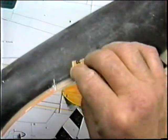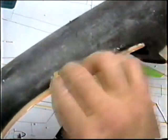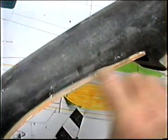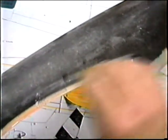And the idea on a fillet is not to build up a lot of paint, especially if you're using something with talc in it. Anything with talc near a fillet almost guarantees you're going to have a problem. If you're doing talc, you want to bring the talc right down but not out onto the fillet. I prefer, that's one place I really would use the Brodak primer. But I want to see if I can get rid of all the primer.